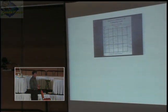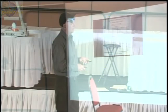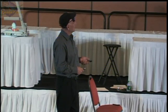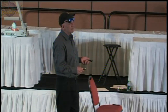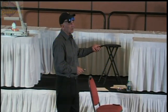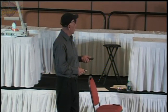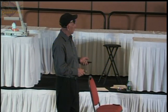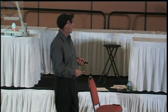These motors are highly efficient when you use a lot of windings, but you have to worry about this collapsing field. So one thing you can do is leave the iron out, and then the collapsing field is exactly equal or a little less than the energy going in, the voltage going in. So that's the direction I took, and I came up with some principles here after playing around with this motor tester.